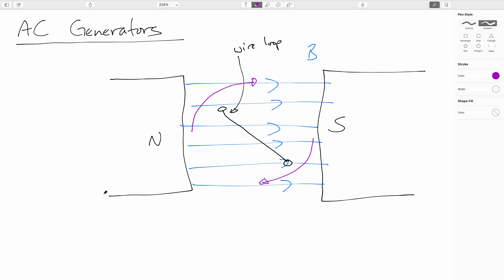This could be like a yoke style magnet that comes around on the backside and leaves a gap in the middle, but there are a zillion different designs out there. As this goes around, these in and out bits are going to be having motional EMF generated. They'll start shoving a current along. So the way I've got this drawn here, we would be flowing a current into the — actually let's use a different color there.